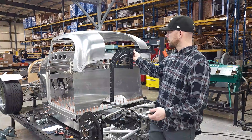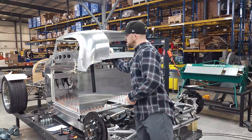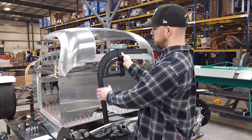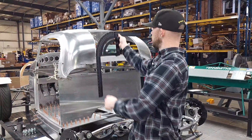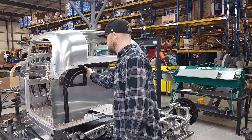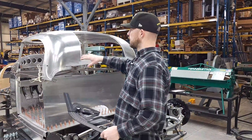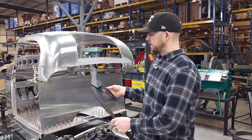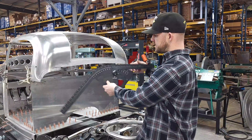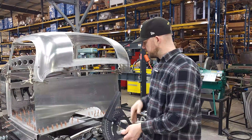If I was building some type of roll cage project in this, you can use this inside of the body to see where the bend protractor is going to line up on the centerline — on one side and then across the roof — and go from your mounting points. You can change your angle if you're trying to do something else, and once you get a main hoop in, if you're trying to come off of there with some other tubes, you can use these in all different ways to line up and judge your angles on certain projects.